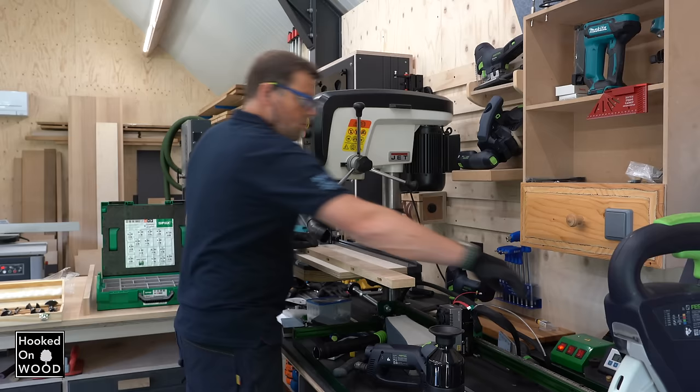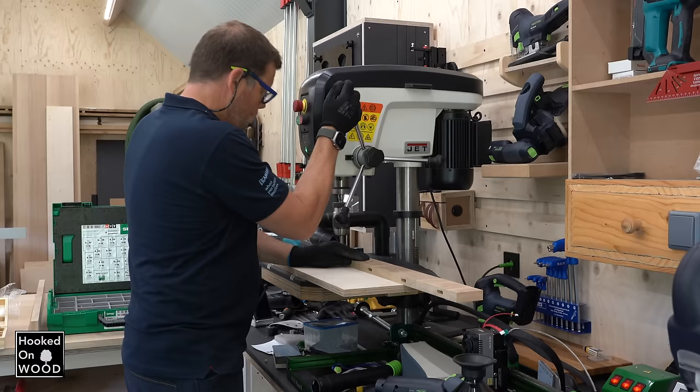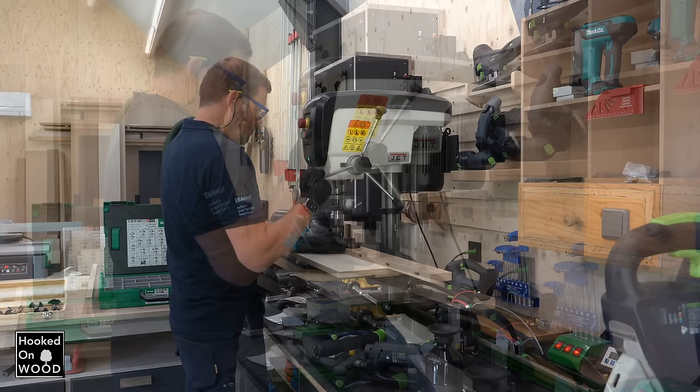I had to make some holes in the crossbars for cable management. And here I made a 41mm hole with a Forstner bit. And it is a shame my hand is before the action. But you can see my dust extraction system takes care of 98% of the wood chips. And I'm still thrilled with my drill press station and my dust extraction system.